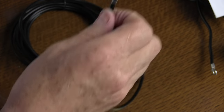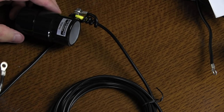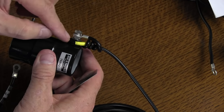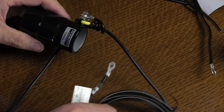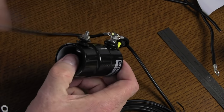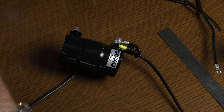First thing you want to do is get your A wire — I've already started it. This is the end that's going to go to the balun. What you do is measure 16 centimeters, then do a loop and wrap it around this type of insulator right here. All the nuts are going to be loosened up so there's some play. I've already assembled A — the A wire goes right here to the 40 meter or 7 MHz coil — and it's got a little tuning stub. The next thing I want to do is get the B wire.